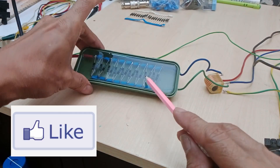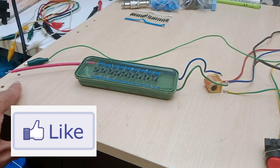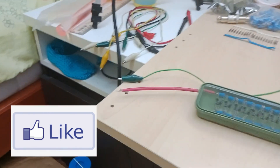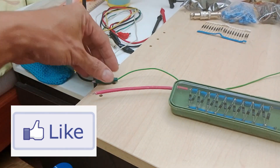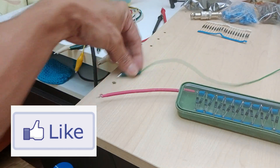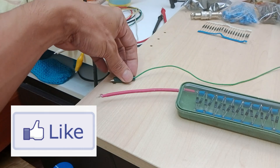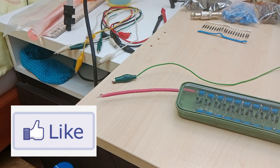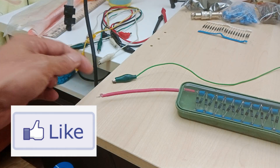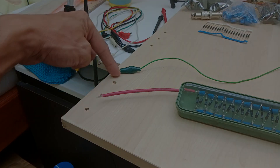This is a voltage multiplier circuit I made for testing purposes. The green wire is connected to earth ground, placed near the high voltage electrode output. Varying the distance from the tip of the electrode relative to ground changes the current or microampere, and the power supply will adjust the output voltage to maintain a constant current, since excessive charge is undesirable in powder coating.